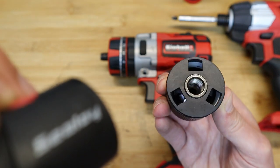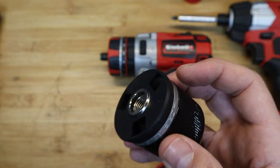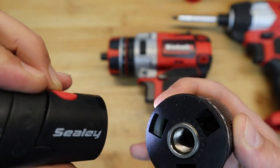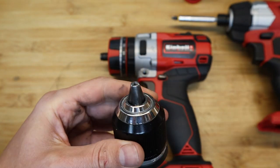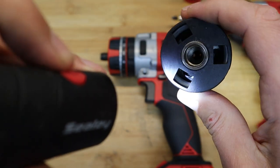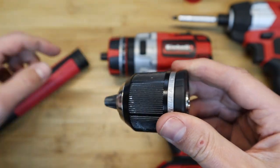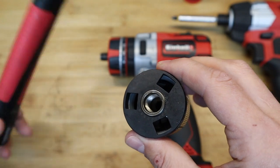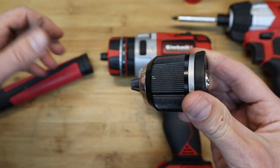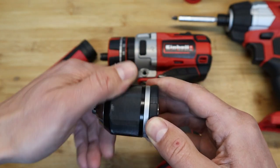You can see there's a nice amount of grease inside. The chuck is entirely metal apart from two plastic cosmetic pieces around the back — they have no structural properties. The three pins that hold your drill bits in place: as you turn the ring, you're turning a large-diameter threaded piece, which drives those three pins in or out to loosen or tighten the chuck.